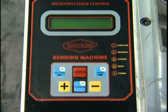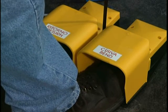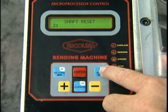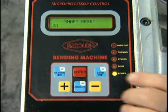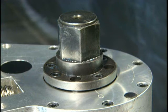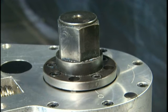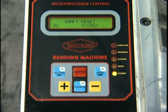Should the shaft require further alignment, power the machine off, depress and hold either foot pedal. Then power the machine on and release the foot pedal. The display should now read shaft reset mode. Use the foot pedals or control bend return keys to align the mark on the hex shaft to the line on the main casting. Depress the enter button to reset the C-axis reading to zero.